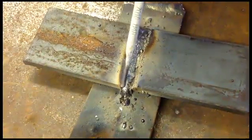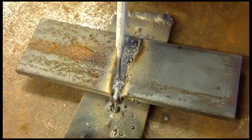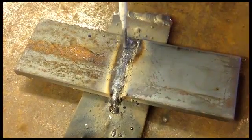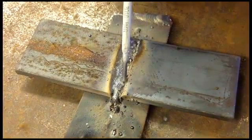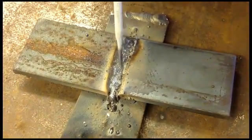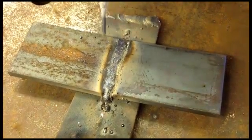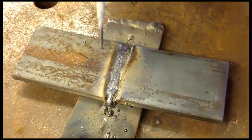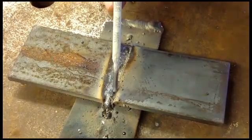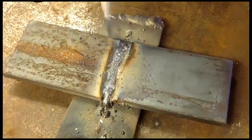As you can see, when I welded I tacked both sides, but when I started my weld I started to creep up on this side. I've got a good weld here but there's a gap on this side, leaving a whole bunch of slag that either has to be chipped out or ground out. When you're doing structural steel you cannot grind, you can only use a wire wheel, so more than likely this will come out as porosity and it's going to give you a weak weld, especially if they x-ray it.